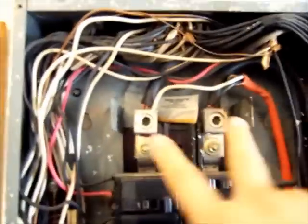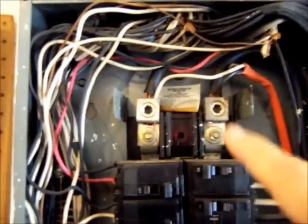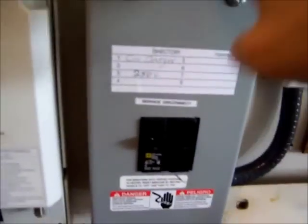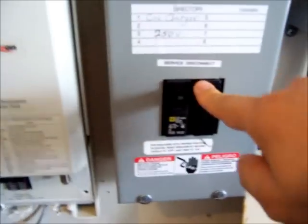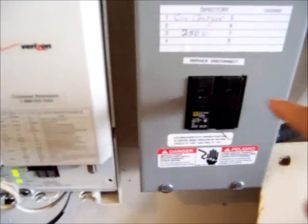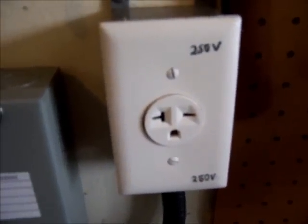You basically take your fuse box — since I'm going to charge at 220 volts, you have to take the power from the two main input lines. So you take the orange cable and put it into a separate fuse box, running the cable into each one of the switches, and then bringing this connector for my car.